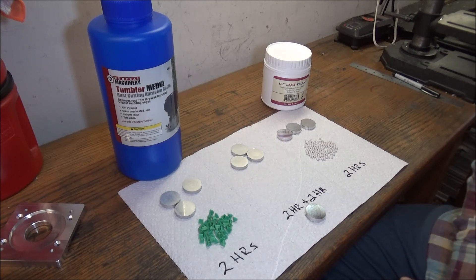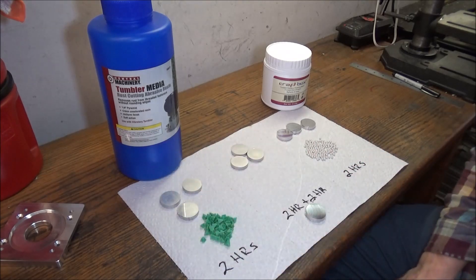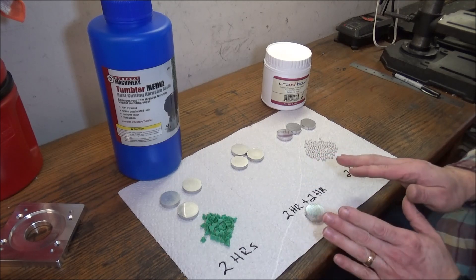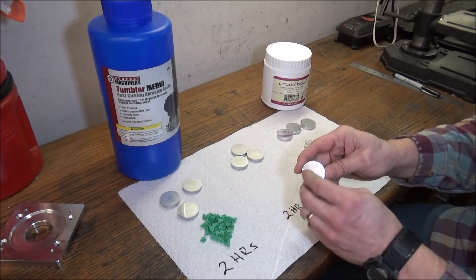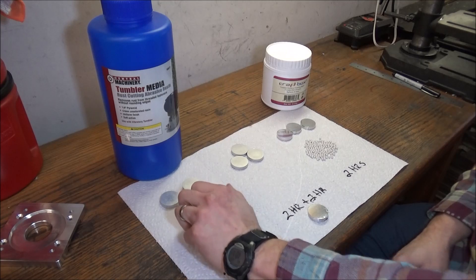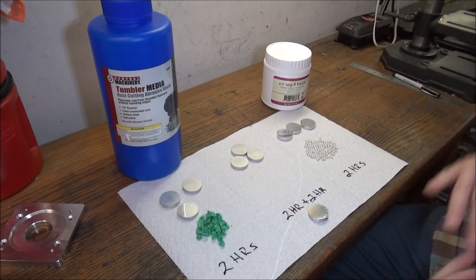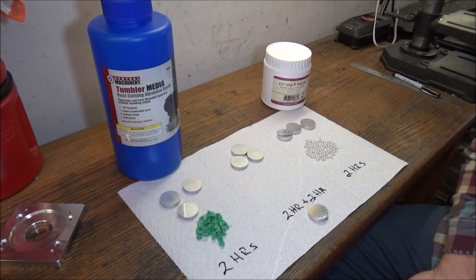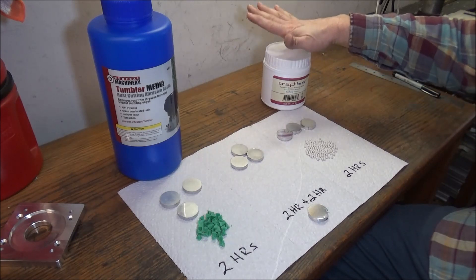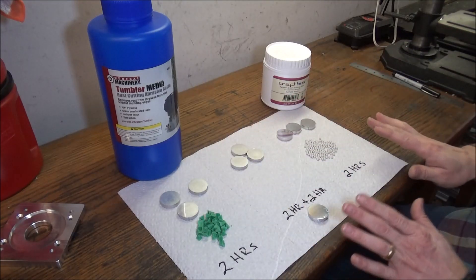To wrap up: this experiment gave a good idea of what different media will do on aluminum for a tumbled finish. I think it turned out really well and it's going to save me time, because before I was knocking edges off with a buffing wheel — it came out nice and shiny but was very time consuming. Just tossing parts in the tumbler, turning it on, and coming back later is going to give me a nice finish without standing there doing it one by one. For bigger more aggressive edge-breaking there are larger triangles, but for what I was trying to achieve this combination works well.